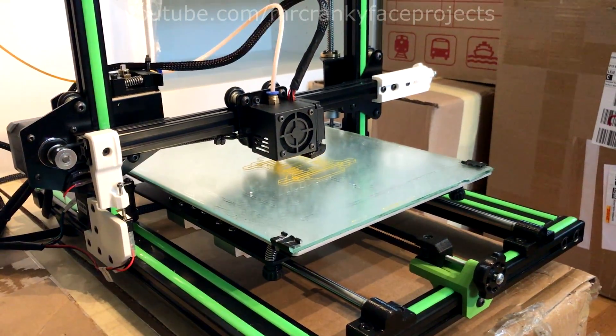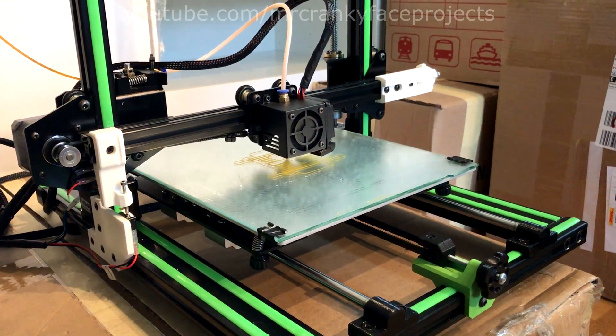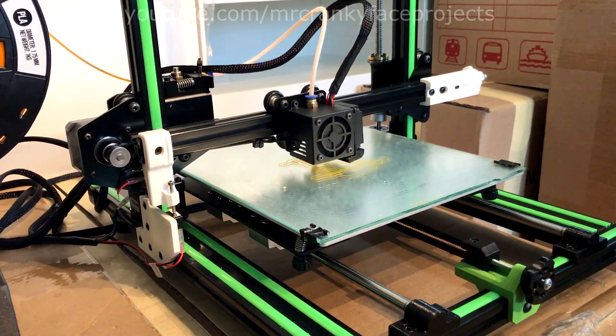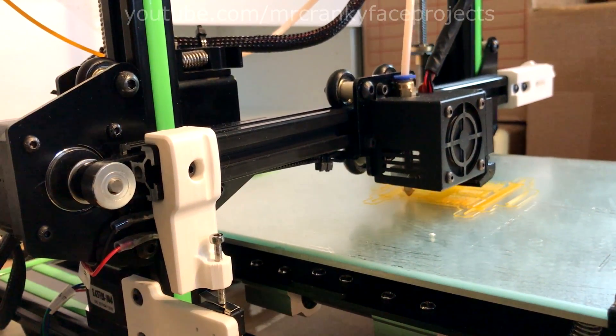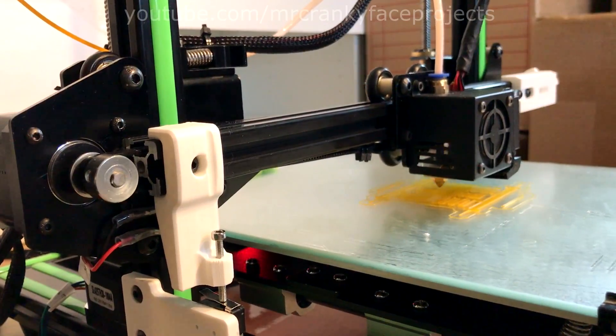After adding the glass plate, I quickly realized I wanted an adjustable Z end-stop to easily change the overall height instead of having to re-adjust every separate bed knob every time I changed the plate and so on. You can see the new bracket here on the left. You adjust the screw attached to the X-axis to change the end-stop height. This mostly uses stock hardware, but requires a longer M3 screw for the actual adjustment.